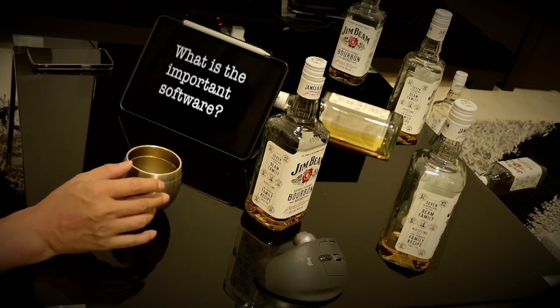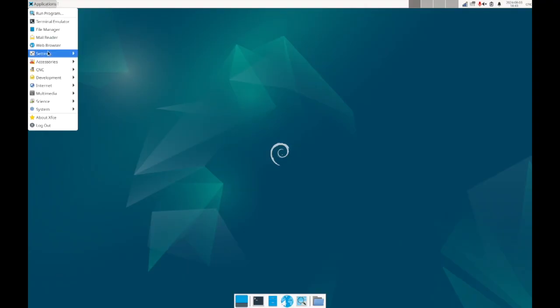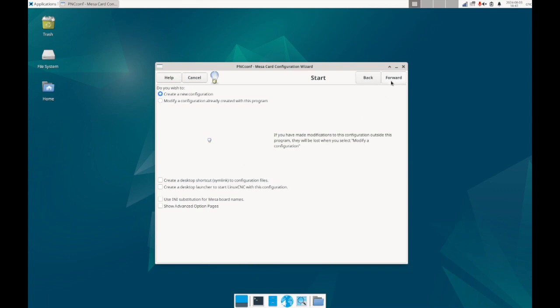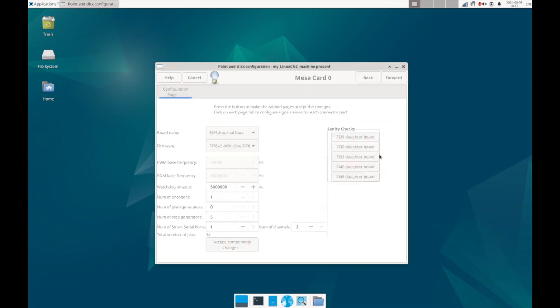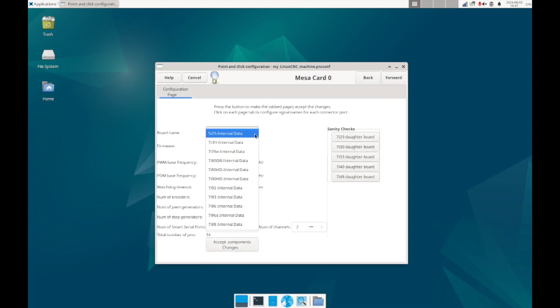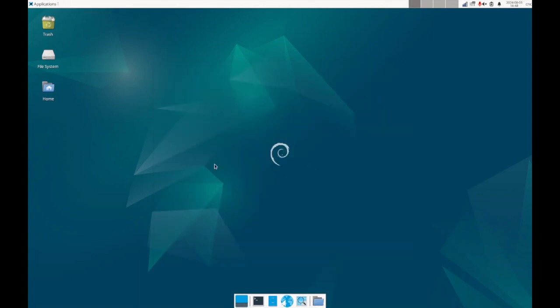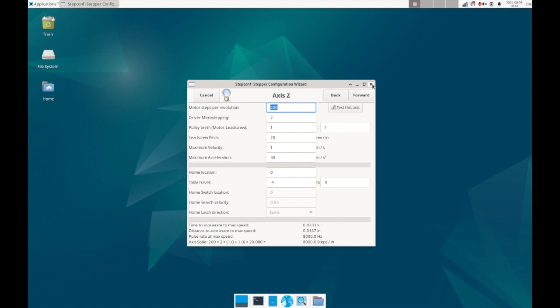So it's like setting up a printer, selecting the model and network settings on the setup page. There are ways to set it up like Angel says: LinuxCNC PNCconf Wizard or LinuxCNC Stepconf Wizard. You can easily set this up to suit your machine. However, this does not support 5-axis and the options are limited. When something goes wrong, this method alone will not be sufficient. When you want to add some new functionality, you can't do anything. For example, when you want to be able to use a jog wheel, you can't do anything. So, as a result, you have to edit the LinuxCNC folder directly.